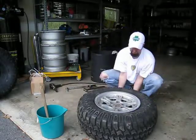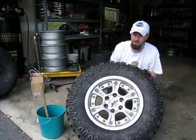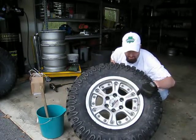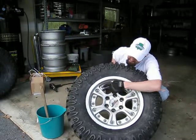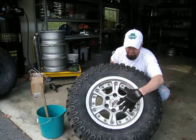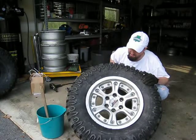As you can see, even if you were to jump on this thing, as you can tell, your lower bolts don't stick up far enough to actually be able to reach to start a nut on them. And that's the whole purpose of these three starter bolts — this triangle of three starter bolts. If you can get a nut going on these and torque them down to where it'll pull the two pieces together, then you can start and torque down the rest of the nuts.